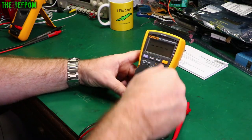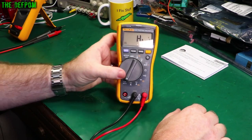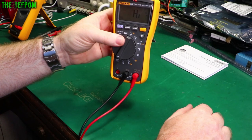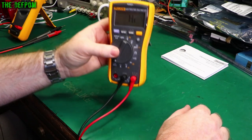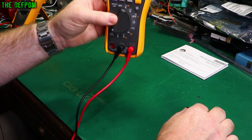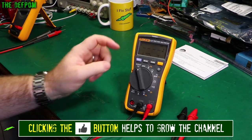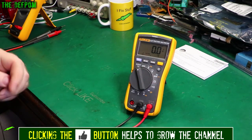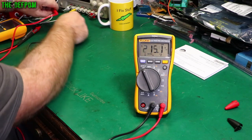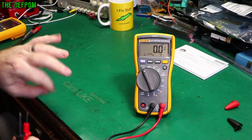The volt alert is detecting my lighting from about 40 centimeters away. On low range it's about 20 centimeters. In auto-voltage mode, shoving the leads into a mains socket gives 232 volts AC. Checking my power supply preset to 8 volts DC — there it is. You can switch between AC and DC just fine, no worries whatsoever.